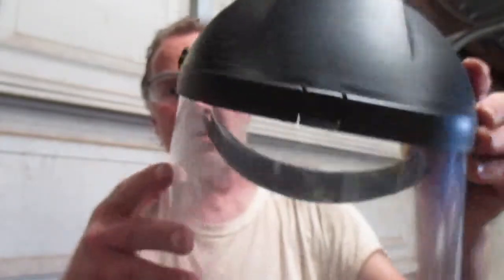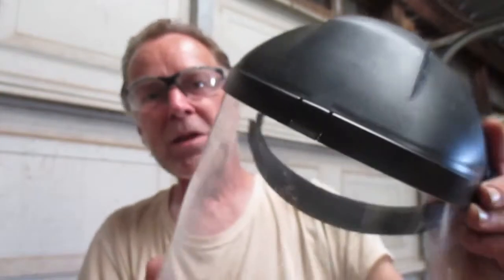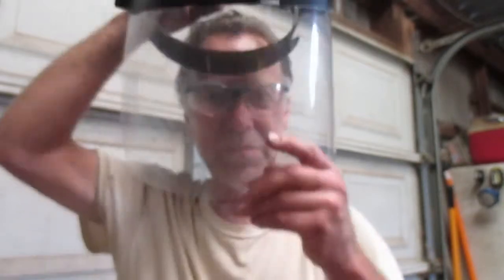And in some cases, like if I'm doing some grinding on metal, a lot of times safety glasses alone are not quite enough because particles just fly out all over the place. So in some cases I use a full face shield like you can see right here. Don't mean to start looking like Darth Vader or something. But it's very important to have one of these on hand. It's also very strong, basically plexiglass here in the front. This will keep any particles out, or a lot of times I'm working with different types of chemicals and solvents, and I never want to take a chance on having an eye injury or something splash into my face. So we just slip this on.